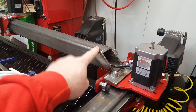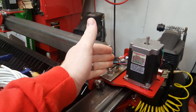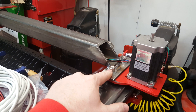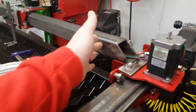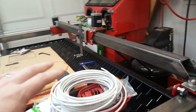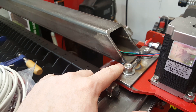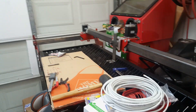I also had to make a modification to this rail. It came all the way over here originally. I cut it a little bit shorter at a 45, made our plate, and threaded the holes on this carriage, making sure it was at 90 degrees to this rail. I measured it three or four times, made our little plate, welded the rail to the plate, and ran our bolts in. And that's how she sits now.